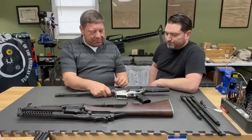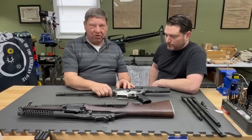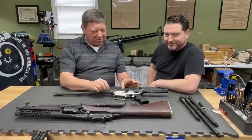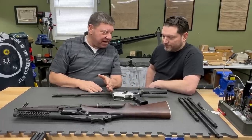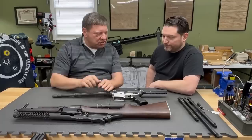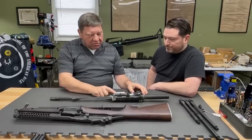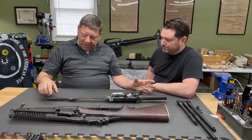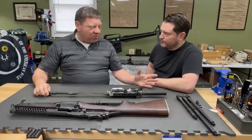The dust cover spring temper was not drawn. Aluminum will melt at just over 1,200 degrees. The part that bent is in the non-pressure component of the gun, and as long as the magazine will snap in and the cartridge presents correctly, that's not an issue. One of the beauties of the Stoner system — and really it's Melvin Johnson's — is that this gun could be made out of paper mache from the receiver back, if the paper mache was strong enough to hold the pins for the fire control group.